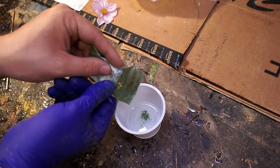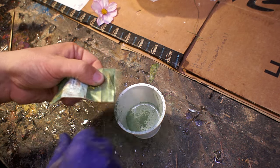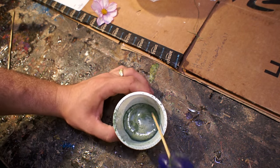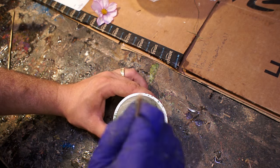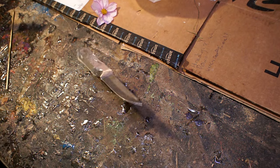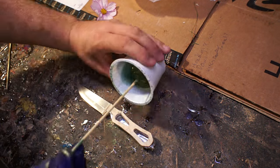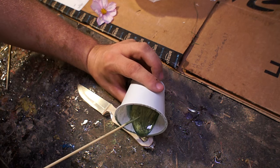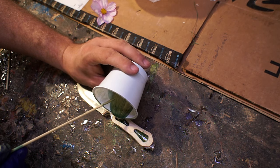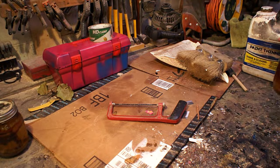I knew that I wanted to have some coloring in the epoxy on the center. It wasn't a very clean metal line on the inside so I wanted to hide it a little bit. This is a pearl coat — you would normally mix it in with an automotive paint, but it also works really well for coloring epoxy and you can get some cool shimmering patterns with it. This is some aluminum tape; it seems to seal better than masking tape or packing tape. I sealed the bottom so I can pour it from the top, then went back and hit it with a heat gun to get all the bubbles out.